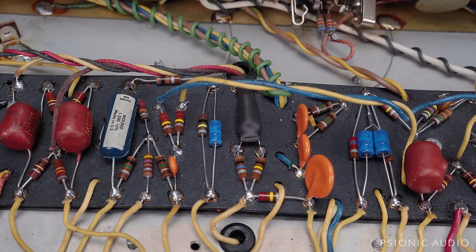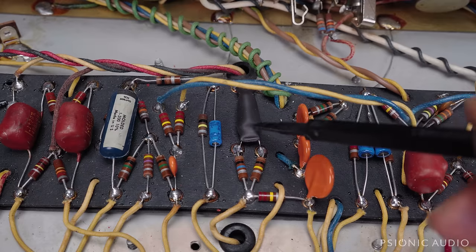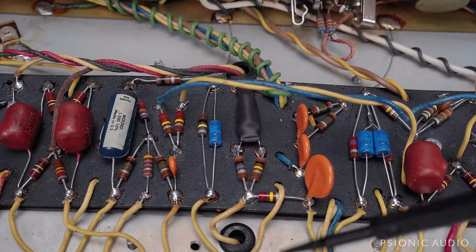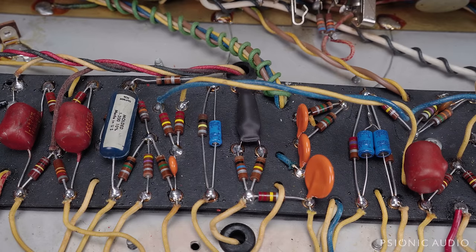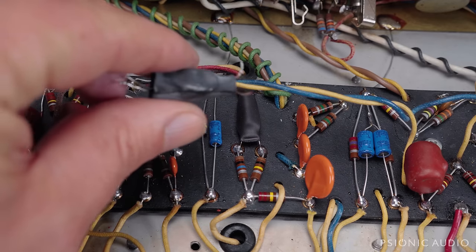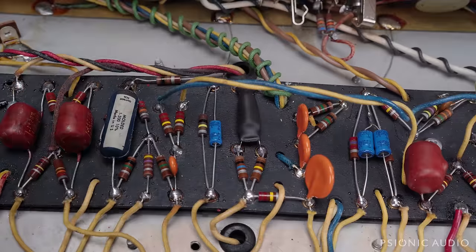When I first evaluated this amp, one of the things was that the tremolo was extraordinarily weak. I could hear it trying to work and could see the light bulb on the roach flashing. I changed this capacitor and these three caps, verified the values of all the resistors in that circuit — they were all good. I tried a different 12AX7 for V5, made no difference. After changing the caps with the old roach in place we had tremolo, but it still wasn't very deep. The LDR on the other end just wasn't going all the way open and all the way closed the way it's supposed to. So I changed out the roach — this one is from Tube Depot.